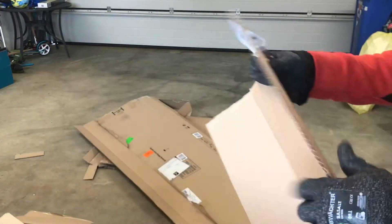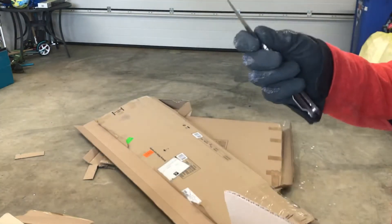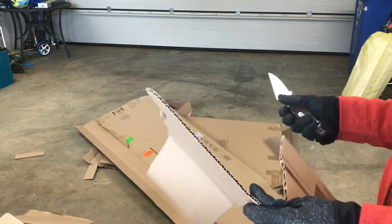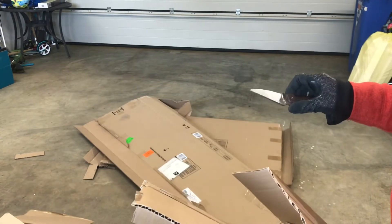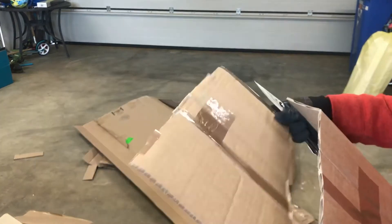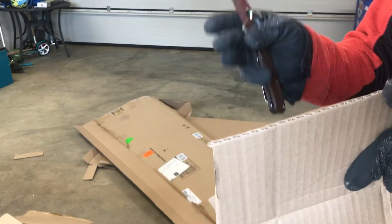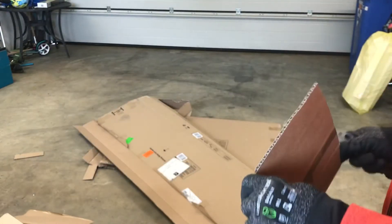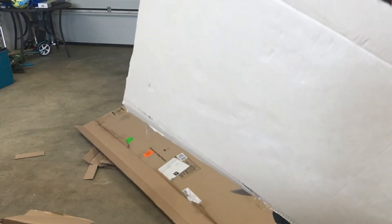The cutting performance has improved dramatically. First of all, the edge has a fraction of the original thickness — it was approaching around 0.7 mm and now it's under 0.25 mm or around that number. And it's convex, so it pushes the material apart first, then decreases the drag higher up the blade. The cutting is really very easy and I'm really impressed — I expected this improvement of course, but it's definitely nice to see it actually happening.